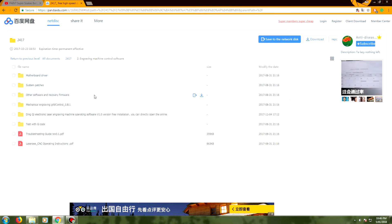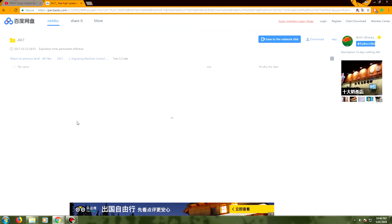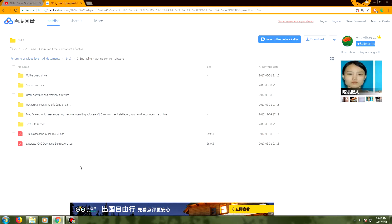The machine is all set up once you've installed the drivers and everything. It's set up to behave correctly so it knows that when it's told to move a millimeter it will do the right number of steps and move a millimeter. What I did find though was that all of the gcode tests on this particular website are useless for me, because my version only has a motor and a spindle — it did not come with a laser cutter, and all the test files here are laser cutter tests. So if you don't have a laser cutter, don't bother downloading that gcode.